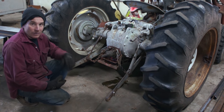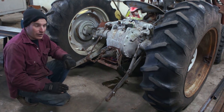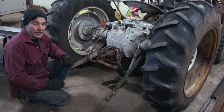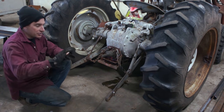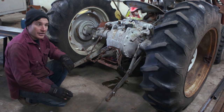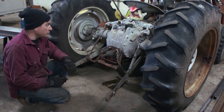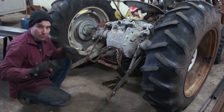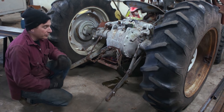I'm gonna use that angle iron that I got and you saw me unload. I'm gonna get some of that heavy angle iron to make kind of the perimeter frame. Then I'm gonna use some eighth inch plate to box it all in to create, you know, an actual box all around it. And then I also got some bracing box tubing to go around the center of it that I may use to kind of weld or fixture other things to, like putting a hitch or something like that on it. I may be able to do that. So for now, let's get the perimeter frame going, get all the plate in place, and that will get us kind of moving in the right direction.